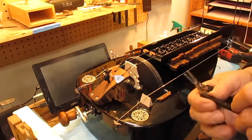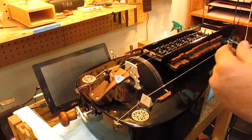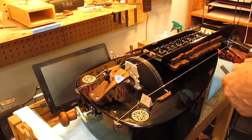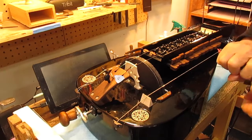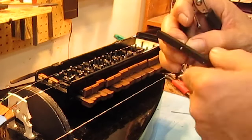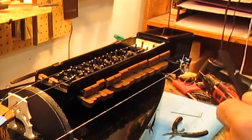I don't anticipate that it will crack. It has to be tight to hold that tangent in place, and you're going to be able to adjust it too. I think I want to turn it with pliers to preserve that head — it's not a really hard metal. You want to take it out to put it back in and then reinstall it. At that point I'll put a little wax on the threads to help it slide real easy right in through there. The threads are nice now, so very happy with that.